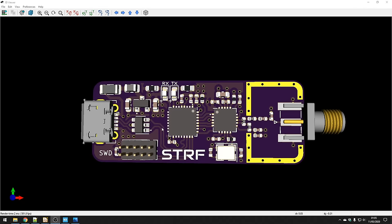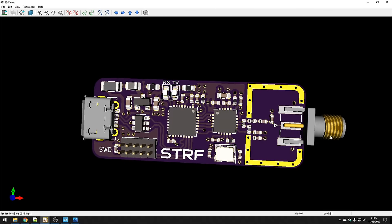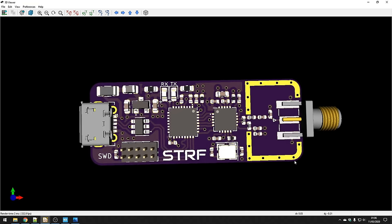Instead of having a PCB antenna, I thought it would be nice to have an SMA connector where we can attach various types of 2.4GHz antennas, so we're not restricted to just one antenna. I also wanted a relatively small form factor — this board is actually 15mm in height and about 40mm in length, so very small. I chose this design because there are quite a lot of interesting aspects of circuit and PCB design, for instance USB differential signalling and RF layout and routing.